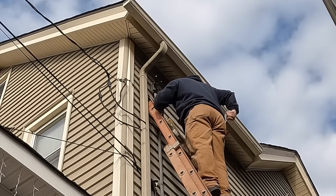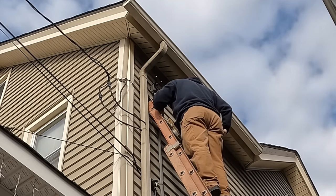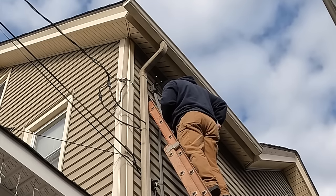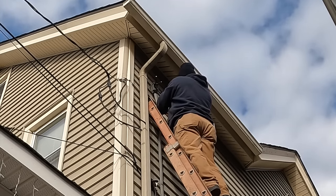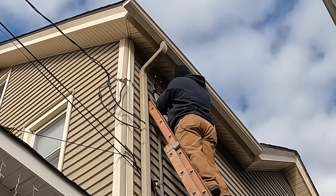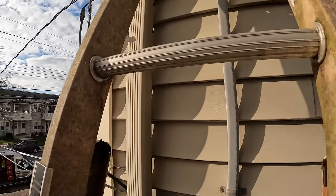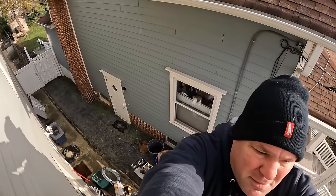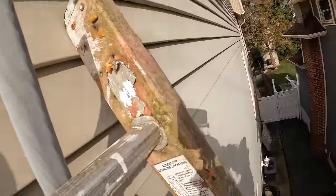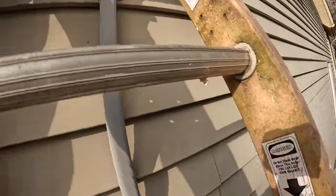All I know is when I took this down and reinstalled it, at the end of the day, I always test the meter can. The voltage that I had between both legs was 207 volts, and I don't believe my work was an error. I'm not sure if JCP&L did this by design, but there is a three-phase set of transformers almost in front of the house here up on the utility pole. So that's a first for me, seeing 208 volts, which is a three-phase Y configuration, on a residential property. Let me know in the comments if you've seen this before.